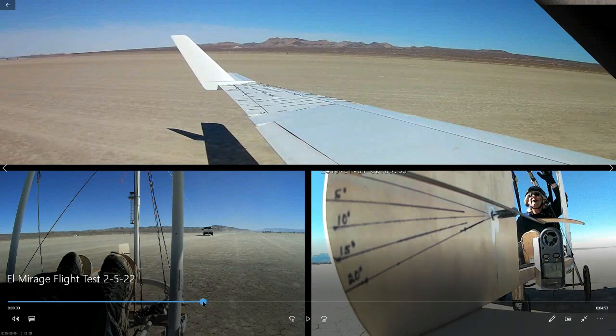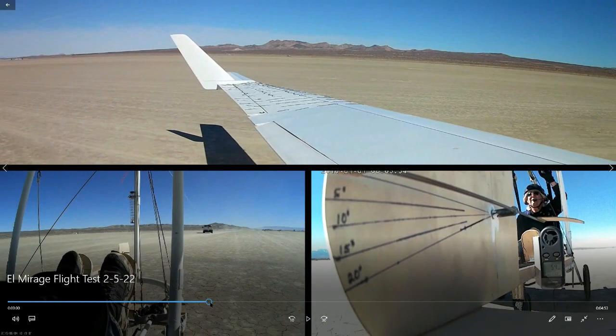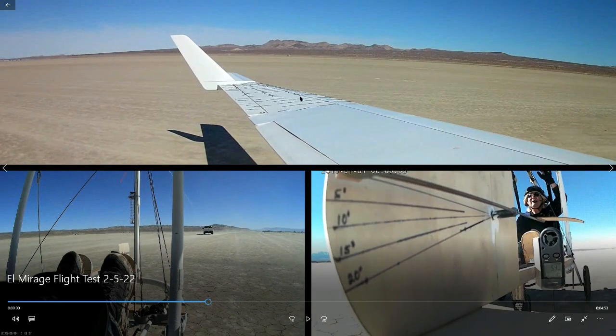So I'm going to let this video run for you here. You're looking at 3 views. Let me pull that back forward again. I tried to synchronize these as best I could. You're looking at the 3 views. The one camera that's on top of the wing looking at the tufts. Here you're looking forward at my feet, and you can watch the control arms here for the cables, and you'll see when I go to full up elevator and nothing happens because the pitch doesn't change.